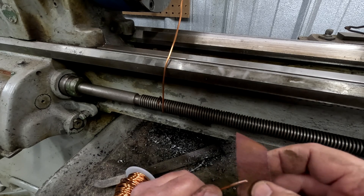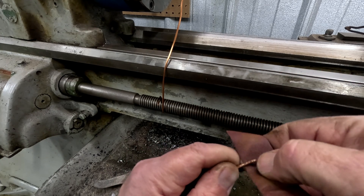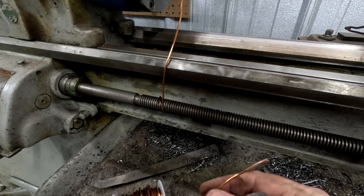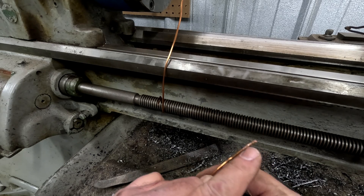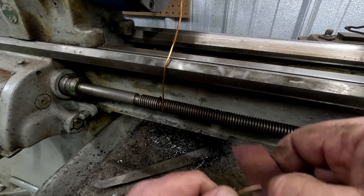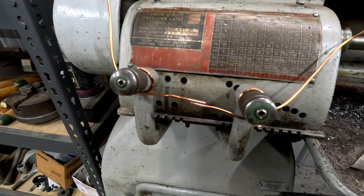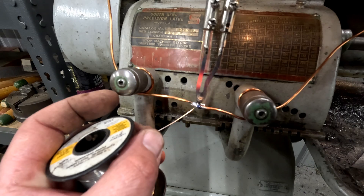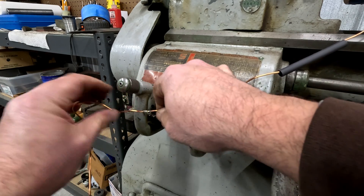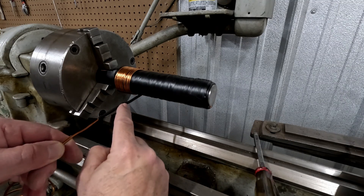I need to make a connection here. This is magnet wire, so it doesn't have normal insulation. To strip it, I actually need to take a piece of sandpaper, a file, or a nail file and just get it to where it shines up. You can see the coating on here and the color change in the copper. We want to get it all nice and cleaned up so it'll solder. I'm going to tin the tip on my soldering gun and solder this. My lathe is going to hold this nicely. Last step — get my heat shrink over that. That's my splice right there.